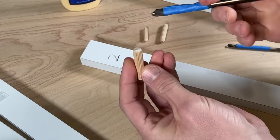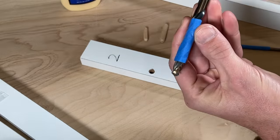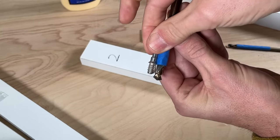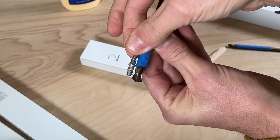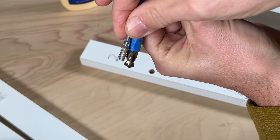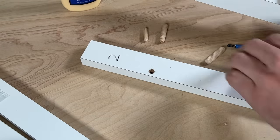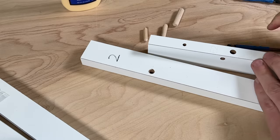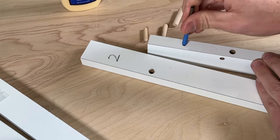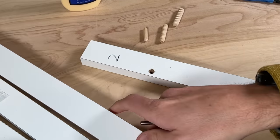You'll be using two different drill bits. One is a 3/8" bit sized to that dowel rod — bore out the hole to 3/8" at a depth just a little more than the threads, marked with painter's tape on the drill bit. Then reference a good hole to know the hole diameter the threads will lock into, which is 3/16" for this example.